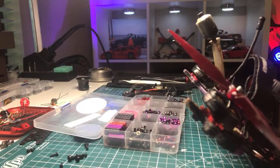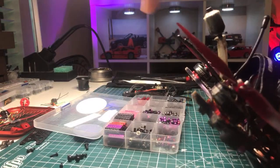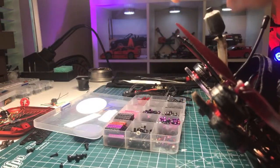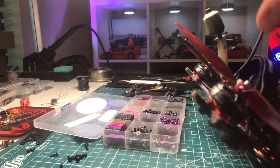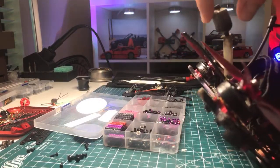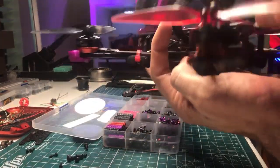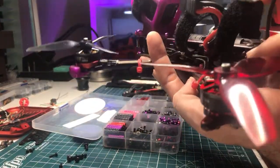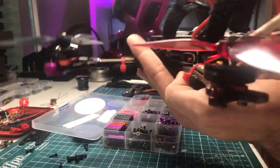So when I'm at a 30 to 45 degree angle flying, the video antenna is absolutely straight up and down. It's circular polarized, so it doesn't have much of a null up and down, but there's still a null. But yeah, the strongest pattern is going like this. So this is gonna give me the best possible video. And then you just gotta figure out a way to mount it. I have these kind of weirdo TPU things that came with some old quads that hold the UFL.